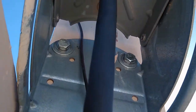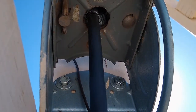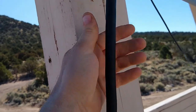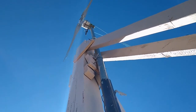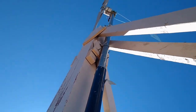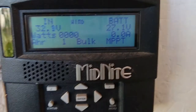Any maintenance is done pretty easily from the roof. The other thing to cut down on maintenance: I don't use a slip ring for the electrical connection at the top. You can see the cable coming down the pipe there — it's just clamped at the top and it just twists when the turbine spins. There's really no tension either direction because the turbine doesn't generally go all the way around; it just goes back and forth when the wind changes direction. It's been set up that way for a couple of years and really hasn't been a problem, so I don't think a slip ring is necessary for a small install like this at all.